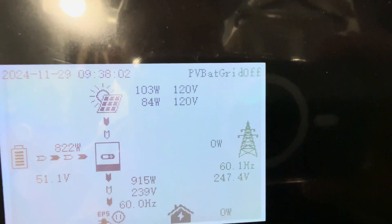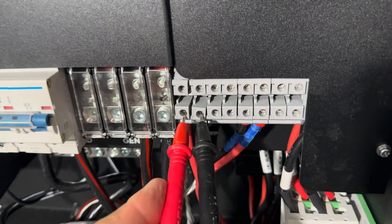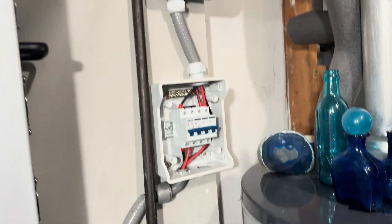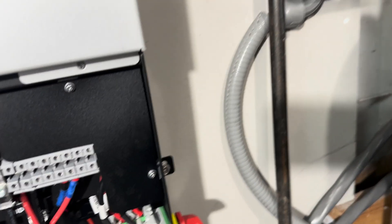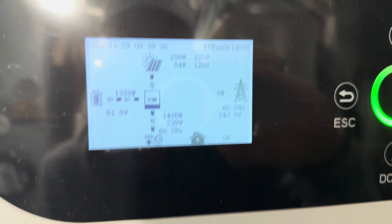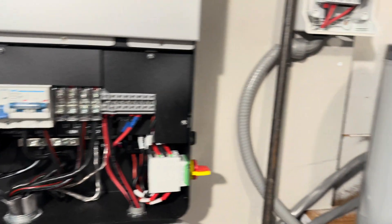This happens every day. Even when I reset it, by the next day it's limited to 120 volts. If I measure it here at the input, it's showing 119 volts. I do have some breakers for my two strings up here on the wall — that also shows 119. Each string has 11 panels and they should be around 40 volts each, so even on a cloudy day it should be better than 120. It holds exactly at 120 or 119 — holds it flat. It's like it's limiting it, and it's running upstream to give me that.